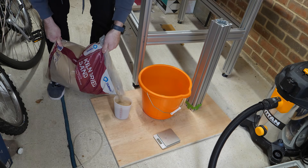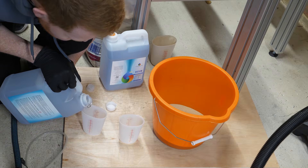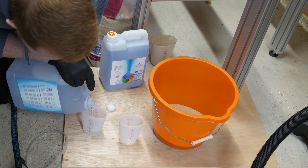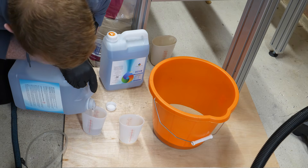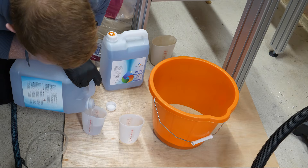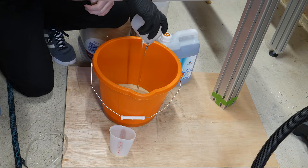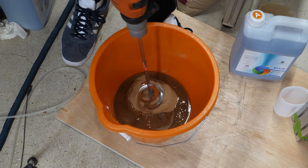Half a litre of sand is roughly 820 grams and epoxy is about 1.2 kilograms per litre, so for every litre of sand I need to add about 273 millilitres of epoxy. This is only a rough calculation and I didn't stick to it consistently, as it's only really to bond the sand together to prevent it leaking out of the extrusions over time. To make the mixing easier I filled the bucket with the sand and one part of epoxy to prevent it curing fast, then mixed it in well with a drill plaster mixer.